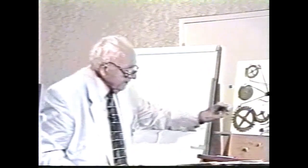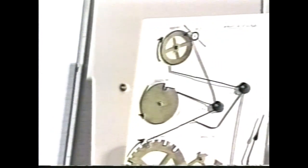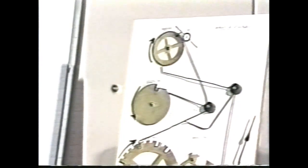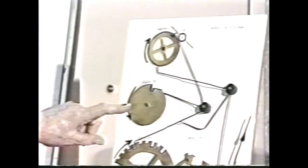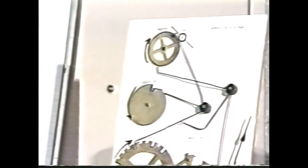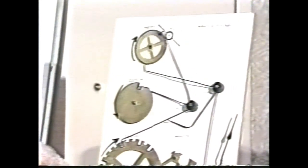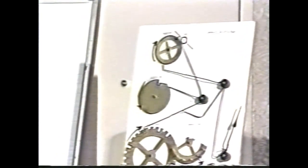Half-hour strike. Oh, one point I want to make. If you have primary locking, do you still need the locking cam? I said, yes. You need it if you have a tooth count wheel because it keeps that. Okay, somebody must be thinking, all right, wise guy, suppose you have a smooth count wheel here. You don't need the locking cam. You really don't. A lot of American clocks do not have locking cams, in spite of what you may have heard. If you have a smooth rim count wheel, you don't need the locking cam for that second function. The locking is taking place on primary locking. Also, surprisingly, in spite of the fact that you don't need the locking cam, if this is a smooth count wheel, more often than not, you'll see it there, as though it was easier to leave it there than to take it out.